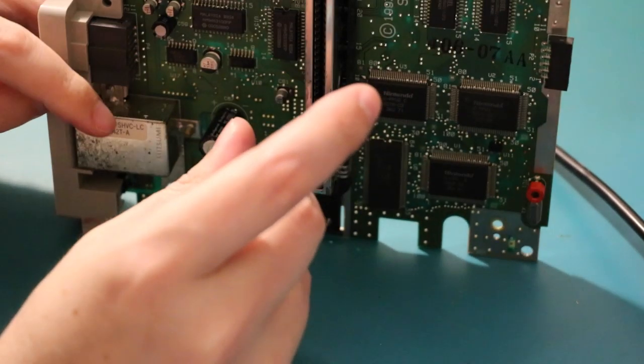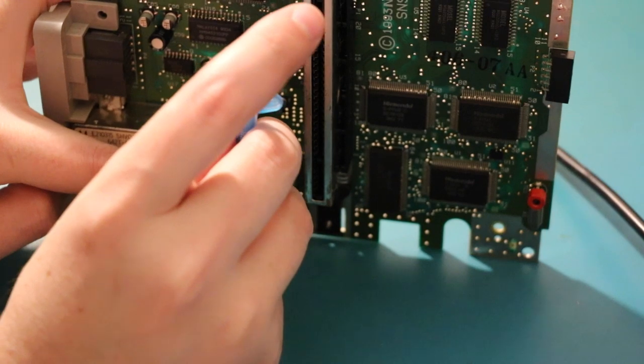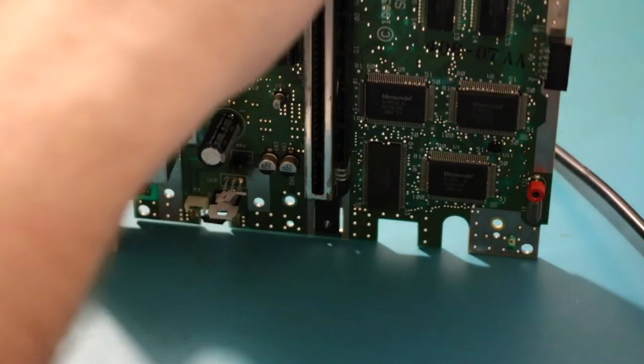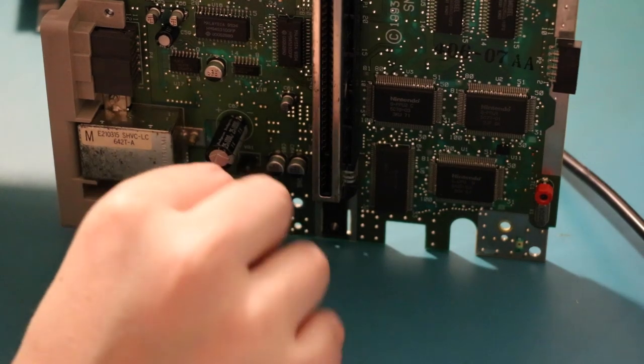Yep, this is possibly the worst thermal paste ever. Also, don't touch thermal paste. It's not good for you. Do as I say, not as I do. Yeah, great. Okay, that's good enough.